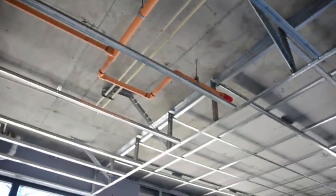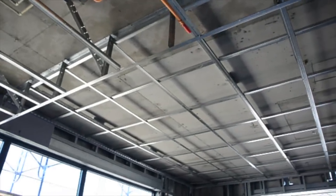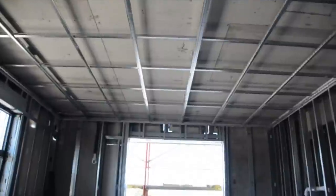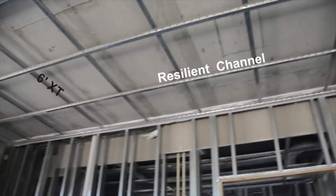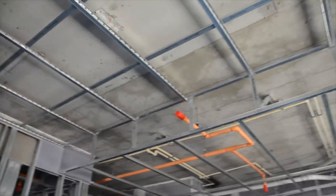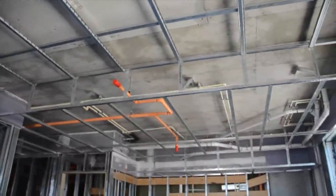Check this out where we now fur up with cut drywall tees to another living area with uptight mains to structure, cross tees, and resilient channel. Always run resilient channel parallel to the main runners and perpendicular to the cross tees. Turning back, you can now see all three levels of the installation with just drywall mains, six-foot cross tees, and cam angle.